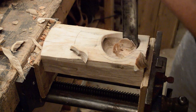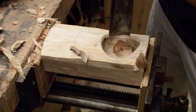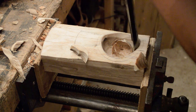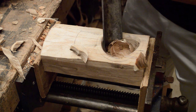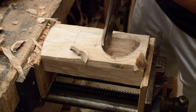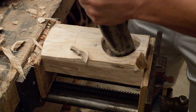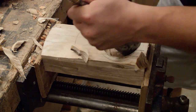So what I end up doing a lot is holding the gouge just like this, and it's kind of a levering action. You've got to try and take off a thin shaving. It's not just gouge and keep gouging — think of it like a plane, you just want to take a consistent shaving off. Two hands, very steady, keep control of your tool. And you can actually do a lot with this gouge.